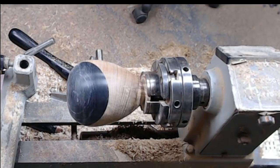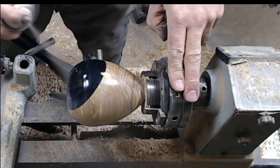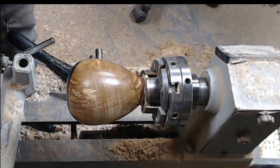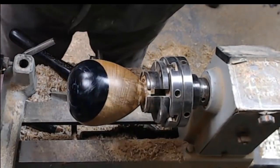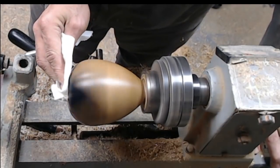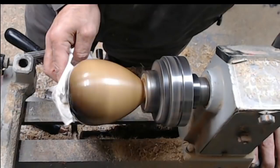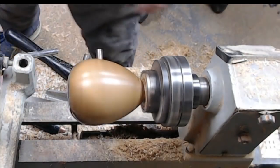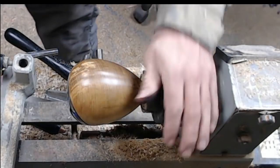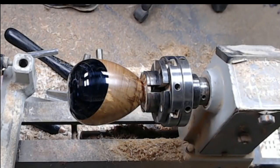I'm going to use the spray sanding sealer, chestnut one, it's just a lot handier. Right, Yorkshire grit time. Bow chicka wow wow. Okay, we'll go with the microfine. Now it's going to be no Fabergé, but it is shiny. Now I think we'll give it a wood wax 22. A wood wax 22.